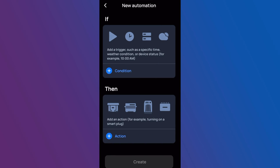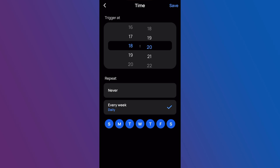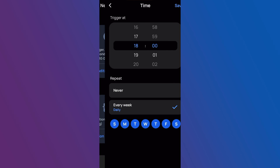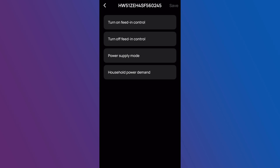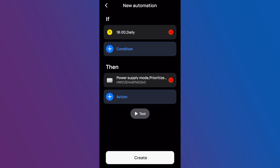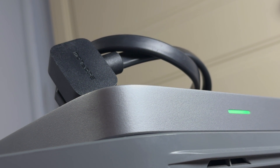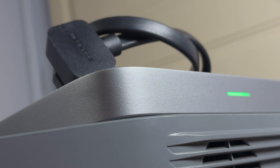EcoFlow lets you schedule automation to automatically switch between the two options. So you can set up the system so that in the morning it will charge the battery, and then at say 6pm it will switch over and consume the Delta battery, putting that energy into your house. But if you want to live off the grid at night or need it when load shedding kicks in, you'll need to take the Delta 2 battery and plug it into your specific appliances when the time comes. It might just be easier to leave the Delta 2 plugged in somewhere else and not attached to the PowerStream, as it functions as an extra source to feed into your home rather than a direct energy backup.